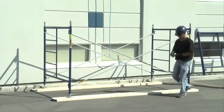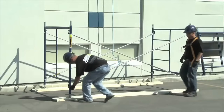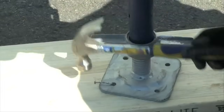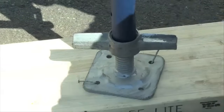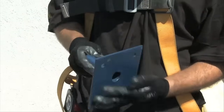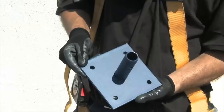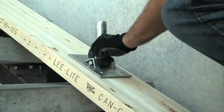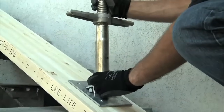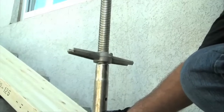You can now set the basis of your leveling jacks. You can use wood screws, or more often two and a half inch twisted framing nails that you bend out — put two in diagonally for each leveling jack. If the ground is perfectly level and straight, you can use the base plate instead of the leveling jack. If there is a slope, such as for a roof, a street, or a garage entrance, you can use a swivel base plate that is used with a leveling jack with socket. Finally, it's very important to remember that it's only once the scaffolding is level and square that it has reached its maximum load capacity.